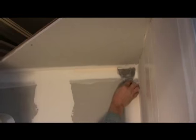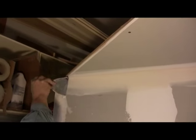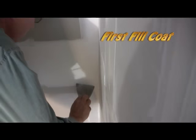Inside corner joint: using the 4-inch knife, scrape down the surface on each side of the corner. There must not be any bumps — the surface must be level for the next coats. Use the 4-inch knife to place a 2 to 3-inch wide coat of mud on one side of the corner. Draw the knife up the entire length, exerting enough pressure to make a thin, uniform coat that is 4 inches wide. You do only one side of the corner at a time. In the final end, you only want 1/16th inch of mud to cover the tape.